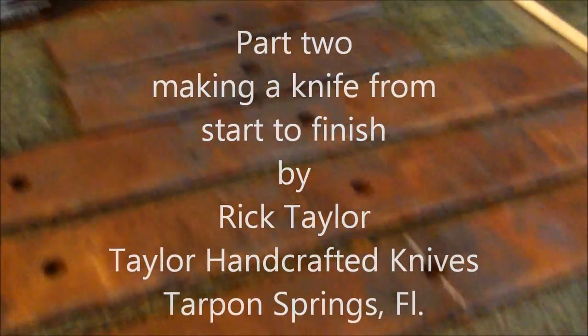Okay, this is part 2 of my building a knife from start to finish. These are the steel springs that you saw me anneal in the forge in the first video. As you can see, they're nice. They're fairly flat. They're not perfectly flat, but they're fairly flat. I'll put them on the anvil, make sure they're perfectly flat, and I'll hammer them cold. Now they've been annealed, they're not as springy as they were. So you can hammer them, you can cut them, you can do all kinds of things.